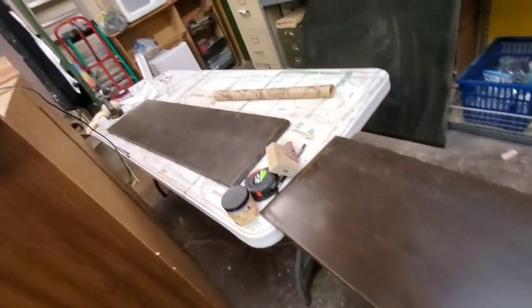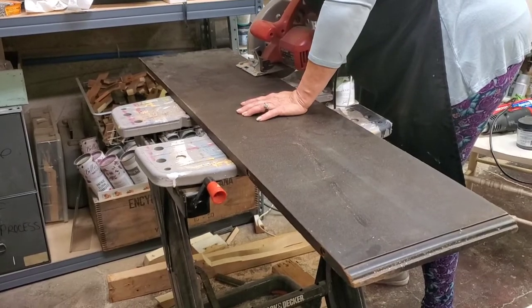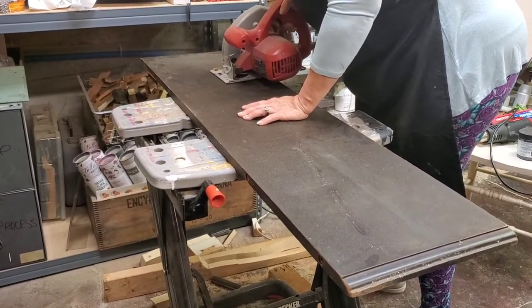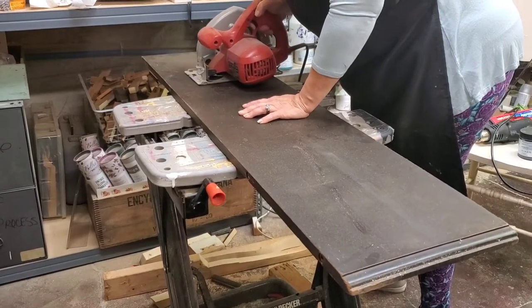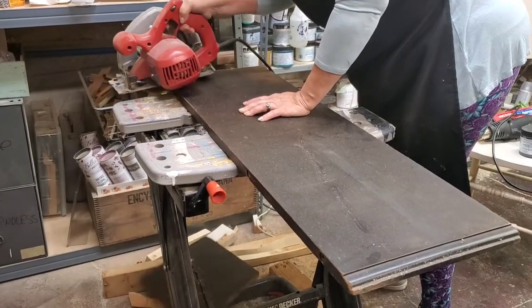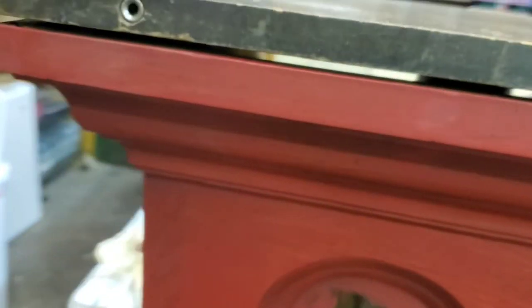When the piece was stood up, it clearly needed a top. So, looking to my stash, I found some table leaves that I could modify and piece together for the top. The little spikes and corresponding holes in the table really helped me to piece this together, but I also used construction adhesive. I pieced it out on the table and then got the most stable piece glued in place with construction adhesive first, and then began to put the rest of the pieces on from there.